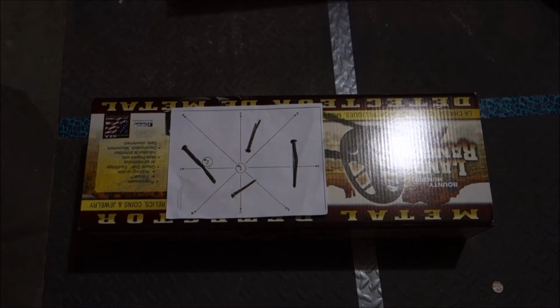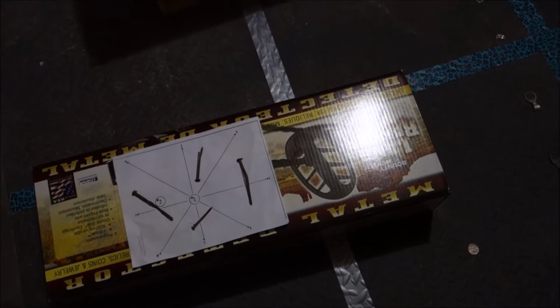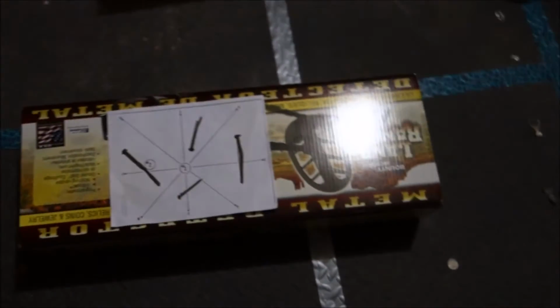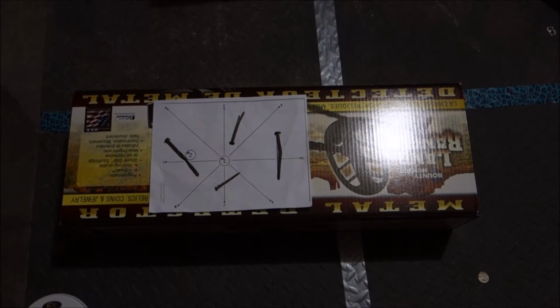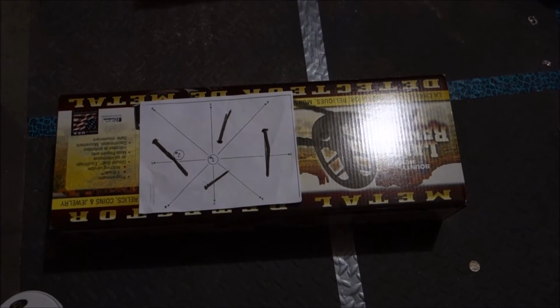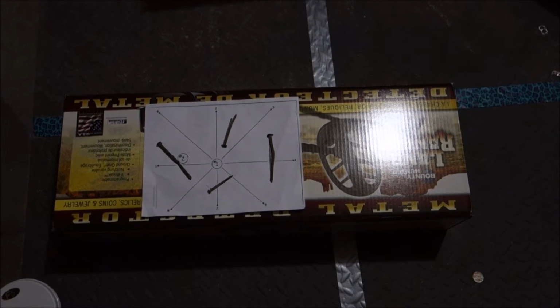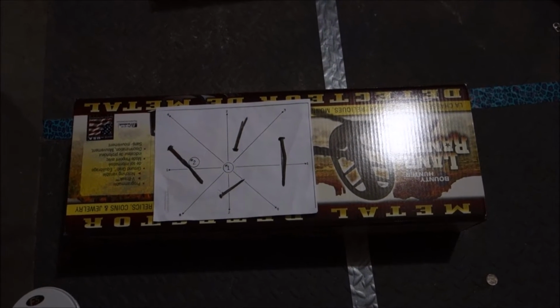But however, I'm going to show you why I think it's pretty good for parks, jewelry hunting, trashy parks, school grounds, and whatnot. I mean, you can use it in a relic site. Just bump it to mode 2. Now I wasn't using it in coin mode because since it bumps the ID down from the 60s down into the 30s, you hear nothing but the low tone. You don't hear the high tone. So I just put it in disc 2, which is VCO only.